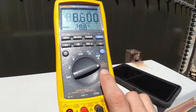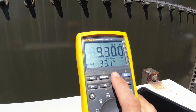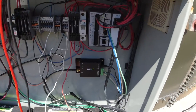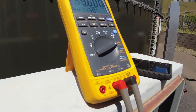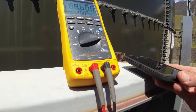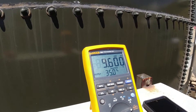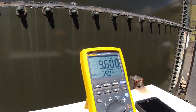I'm also going to inject a four to twenty milliamp signal. I've got my 789 in output mode — custom output mode — pumping out 8.6 milliamps. We'll turn that back up to 9.5 where we were — that's what our transducer was showing earlier. I've just got that fed into my PLC here with some jumper wires and alligator clips, and the original transducer is set aside. So we'll go ahead and call our SCADA guy and see what he's seeing on the radio. I'm pumping in about 9.6 milliamps, 35 percent right now, and that is identical with what the transducer was giving me.